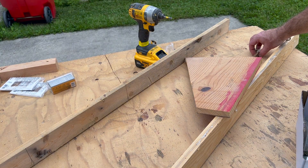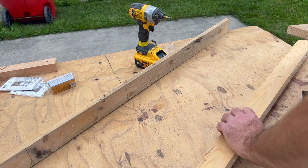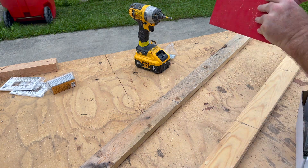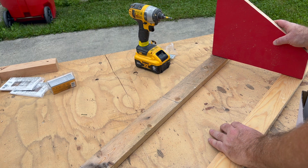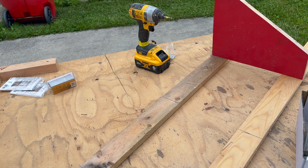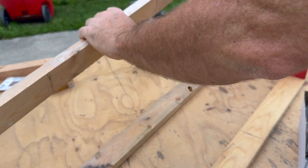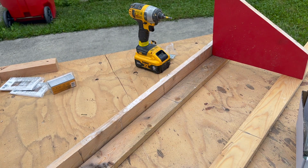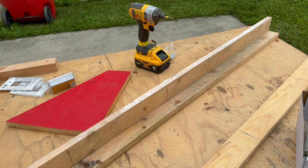I decided to go with some one-by material. We had one-by-threes that we pulled out of the guest house — these used to be the studs inside of the kitchen walls. We've got five of these cut to 52 inches. We're just going to align these panels up, attaching two of the boards to the bottom, one on the face, another on the top edge, and one down at the bottom. That'll get us a nice secure square frame to hold these panels up and divide that space into laying boxes. Step one: I'm going to attach these two boards together to make an L that will run along the door inside of the chicken coop. That'll give a nice firm square footing to hold the panels and keep everything solid.